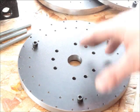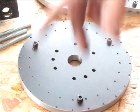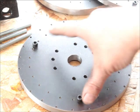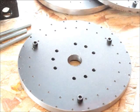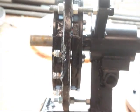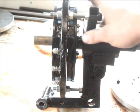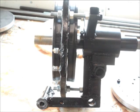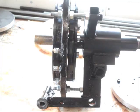Plus, as you go bigger, the rotor size in ratio gets so much larger that the tower and everything else that goes along with it gets toward the extreme. Already, this turbine with the blade set on it, tail, everything set is like 42, 43 pounds. It's pretty heavy. And when the thing gets spinning fast, you need a serious tower on that, with guy wires and everything else.